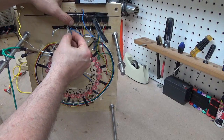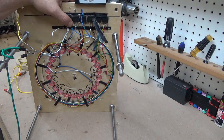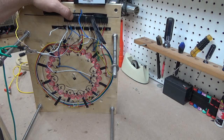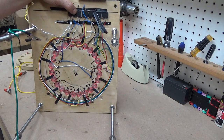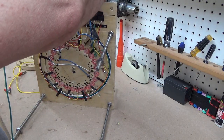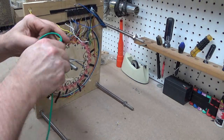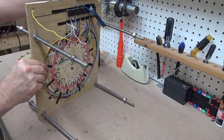I'm going to have to use Hall sensors because reed switches — the longest this thing ran on one reed switch was about six days. You can see the wiring is just like the schematics in the earlier videos. This is a watt meter that I was using for a while. I'm going to have to get some glue release to get the superglue off that board. Let's get our cable off here — that's just the other jumper cable. And that's really all there is to this thing.